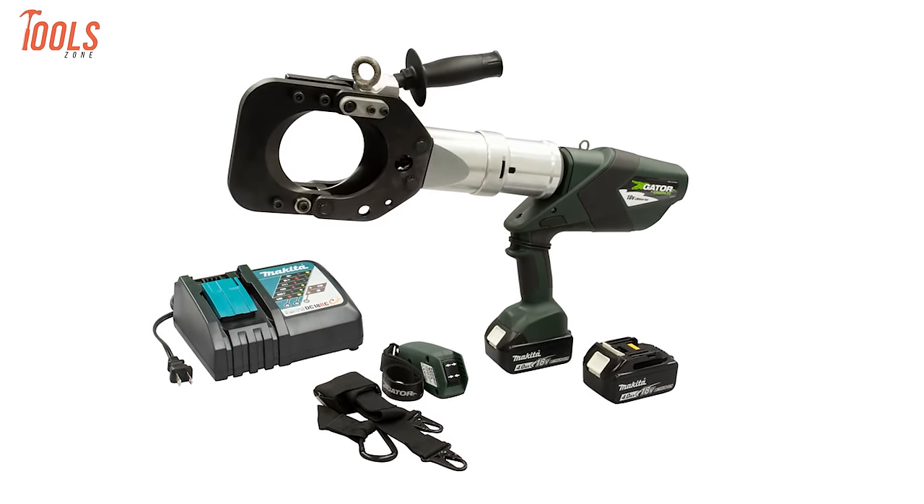Next, the SES Primo Cold Printing Press is an offline solution specifically for embossing cable marker plates used by telecom crews. This portable manual press requires no electricity — simply insert CHM plates and brass characters to make independent markings by hand using the leveraged handle. The integrated magnets hold characters in perfect alignment while pressing, eliminating frustration and speeding up label production. Because the press is lightweight and compact, electricians can transport it to print custom identifiers on demand, and it embosses cable, conduit, and pole markers rapidly without mess or ink, stencils, or templates.